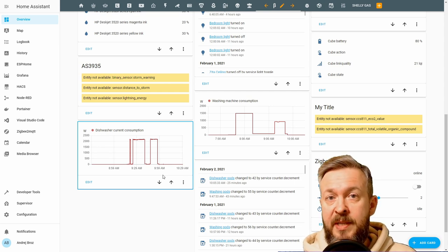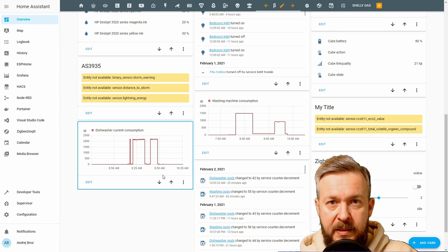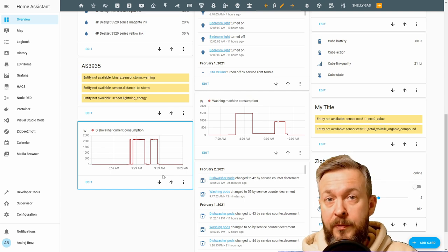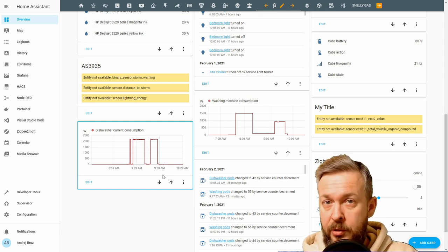To be on the safe side, I also need to create a timer to track if the state is below, say, 2 watts for a period of 90 seconds or even 5 minutes. After the power usage of the dishwasher drops below 2 watts for a period of — depending on your dishwasher and preferences — maybe a minute and a half, 3 minutes, or 5 minutes, we will use this state to trigger that the dishwasher cycle has ended.